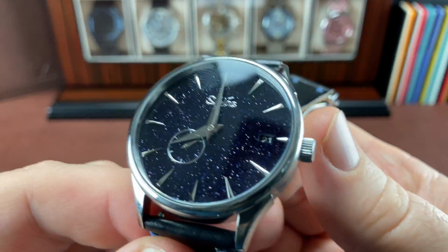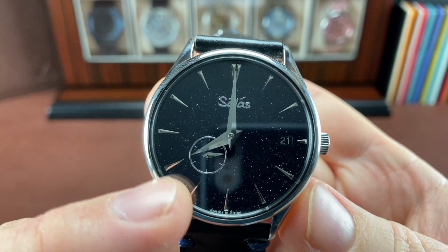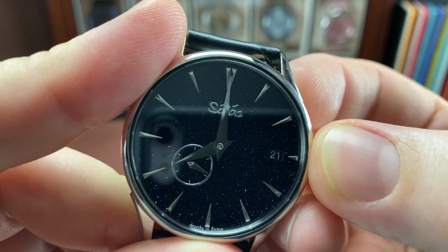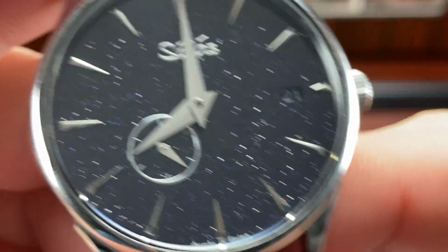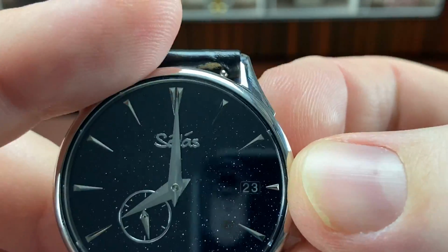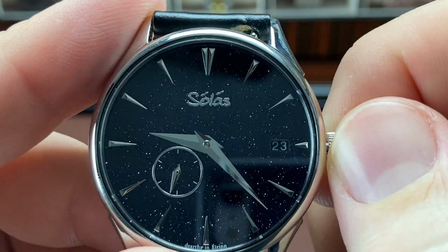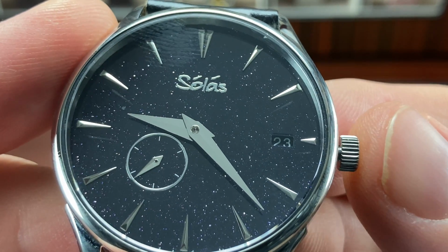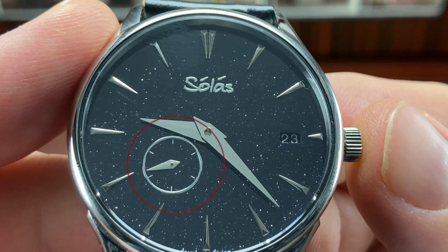You can see on the front, it's got this small seconds down here at like the 8 o'clock position, between 7 and 8. So when you pull the crown out, and I'll do it now for you, and let's zoom in on it. Okay, I can now move. Oh, that's the first position. So you can see I'm changing the date. If I pull it to the second, I can now change the time, and let's get it off of that beautiful logo. But you'll see that even in the out position here, the first and second position, the seconds is still running. And so that's what we talk about when we say it doesn't hack.